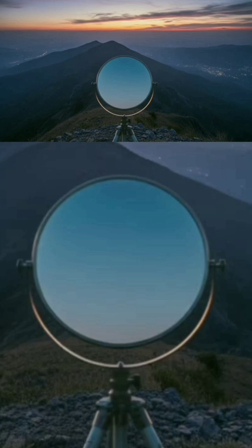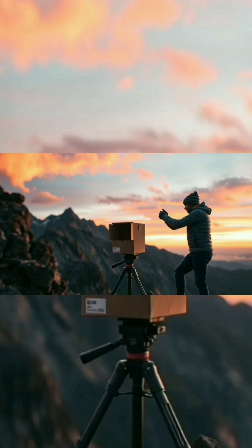The ring requires a number of holes — for example, 10 to 20 — spaced uniformly around the ring's circumference. The holes must be large enough for the laser beam to pass through. The ring must be mounted at the center of the box so a motor can rotate it.